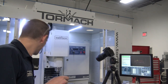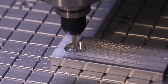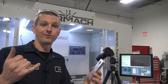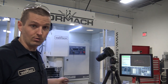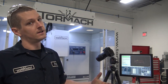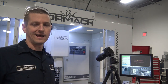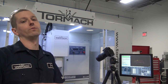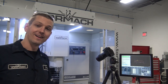I hope you guys enjoyed that. We did goof on our first part — it was totally our fault, but you can see from the footage here we just had a smaller part, so you do have a lot less vacuum power. We actually just poked through too far; I think we just had a tool set a couple thou too deep. I also want to figure out how little you can hold and have this thing work. We ordered a one-inch-thick plate that's going to sit on top of it and hold our vise. TBD if that's the good long-term solution — I wouldn't want to leave this beautiful vacuum plate exposed to daily chips and bangs and clangs. I like the idea of having something more sacrificial over everything, both the mill bed as well as this vacuum plate.